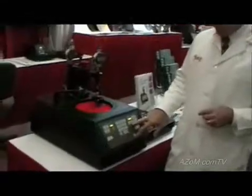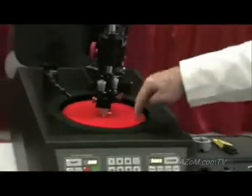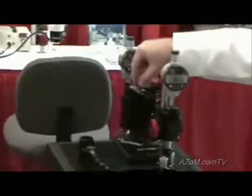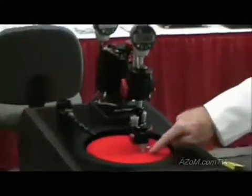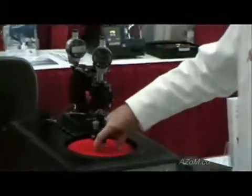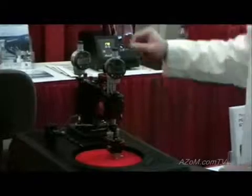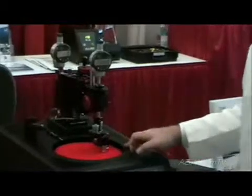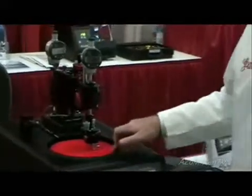The movement of the MultiPrep itself is controlled at the control panel, where we have an oscillation function. The oscillation allows you to move the arm back and forth, where the stroke — the distance that it travels — is controlled through the adjustment of two screws at the back. For example, if the oscillation stroke is occurring in about the middle of the platen, which is not ideal, you can loosen the screw and move it over to make the extreme position near the edge of the wheel, taking advantage of more of the abrasive.